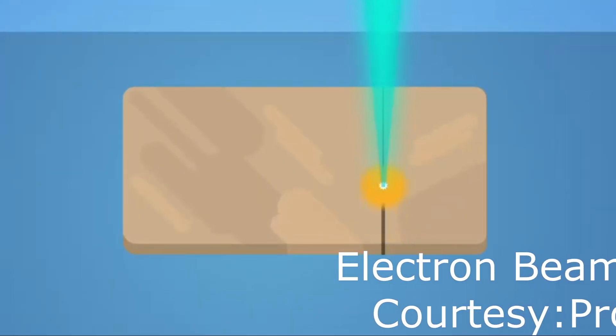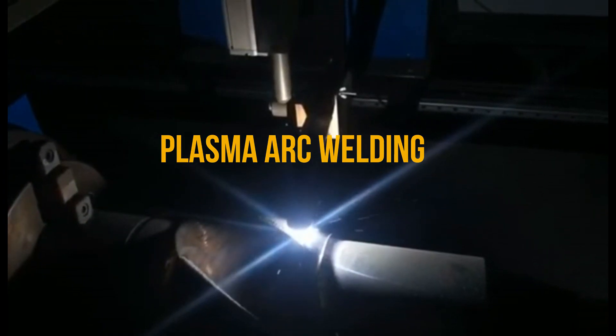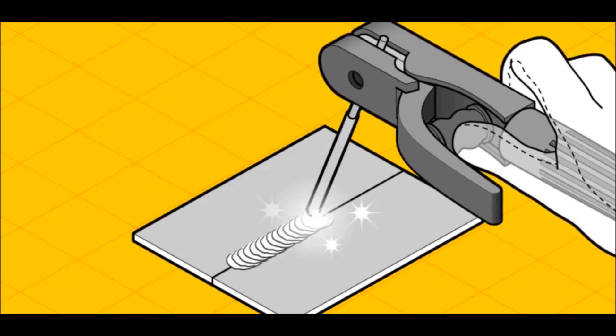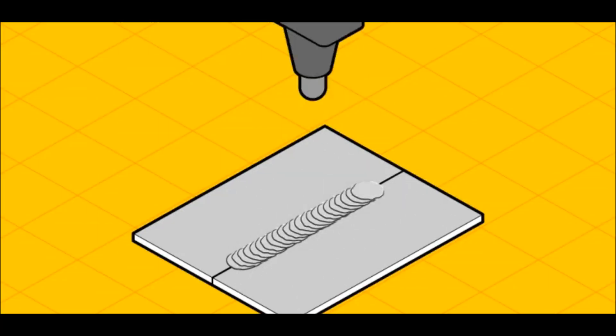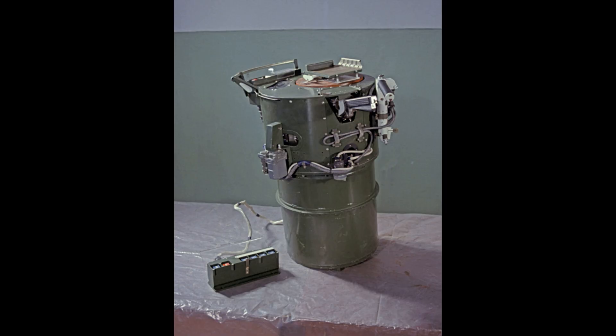He tried out three different welding methods via an electron gun. First was electron beam welding, which sends electrons at very high velocity to the specific areas of the contact surfaces of the metals for joining. Second was low pressure plasma arc welding, where the plasma arc is constricted and requires a water-cooled spray nozzle to restrict the arc to get the properties necessary for welding. Third was consumable electrode welding, another form of arc welding that uses a consumable electrode. The device was equipped with a low pressure arc welder using a consumable electrode, a low pressure arc, a hollow cathode, and an electron beam welder.